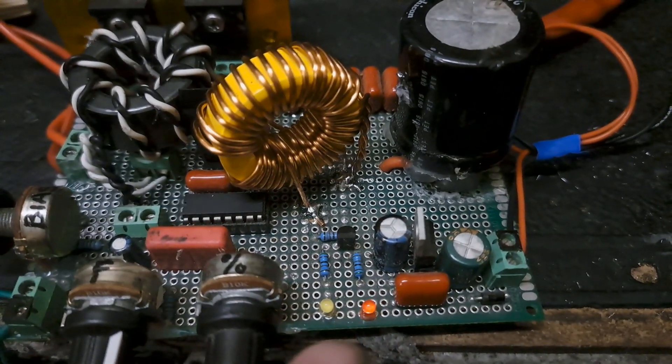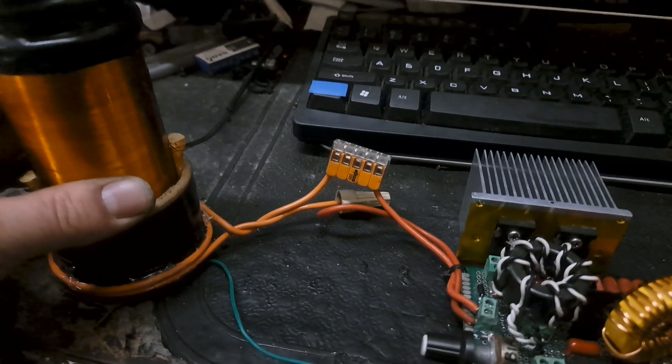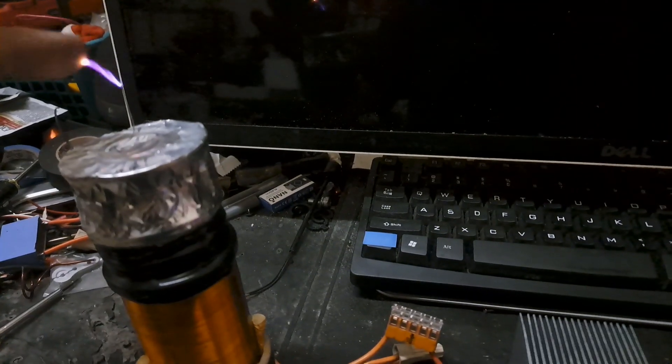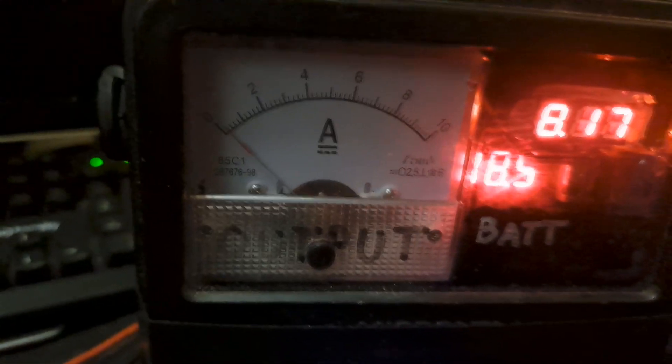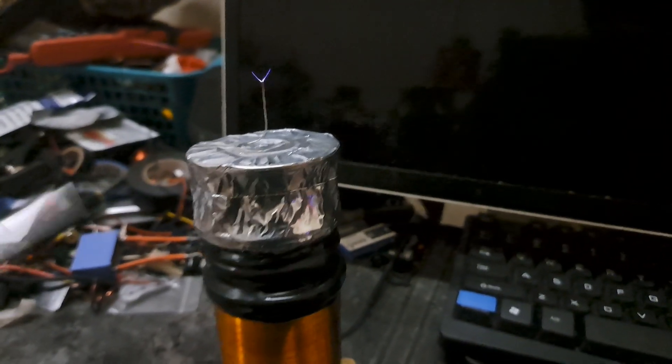I have another setup that I can run at higher voltage. I probably could run these at much higher voltage — haven't tried yet. But from this tuning, I can tell right now that it's just not going to make much difference. I would have to retune this whole thing to run much higher voltage. I can run this down pretty low — put it at about 8.2 volts. The coupling's a little bit lower. Crank the bias up a little bit higher because I don't have a solid 12 volt reference, so I've got to go way up on the pot. I eventually get a little something — that's 9 volts. That doesn't really pull a lot — like 100 milliamps at 8 something.